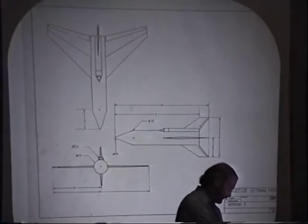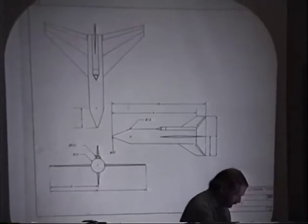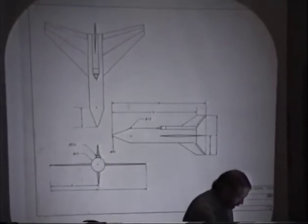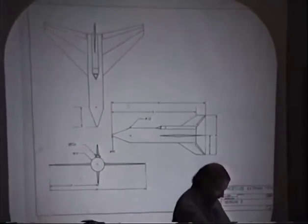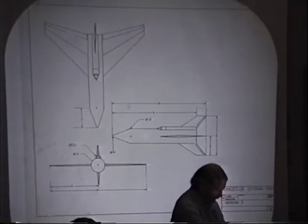It was getting pretty close to the current version here. Changed the wing design a little bit. Well, we changed the wing design a lot, pulled the chord back. And this worked fairly well. It's supersonic and hypersonic. It remained stable. It kept the nose first. It kept the lift and drag where we wanted them to be. Aerodynamics weren't quite as good. It had not as good a lift-to-drag ratio, which meant higher accelerations during reentry and higher heating, but both were still acceptable. However, problems were arising.